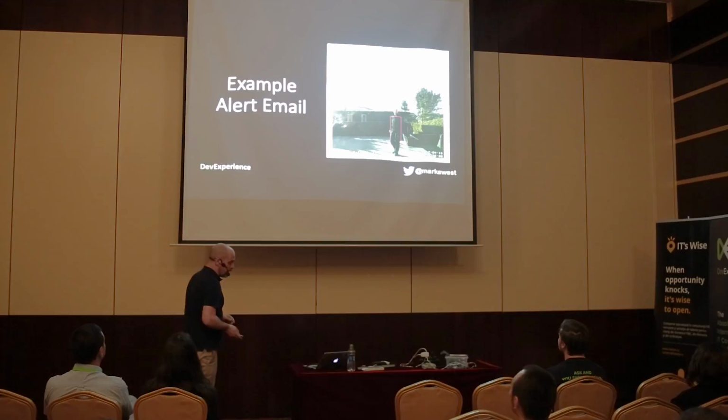So pretty simple. I got this up and running, and it took me 7 hours. Once I had the hardware in front of me, to assemble it took me 15 minutes, but to actually get the SD card, install Raspbian, install Motion, learn how to configure it properly, write the bash scripts, and get everything running took me a little bit longer. So about 7-8 hours in total.